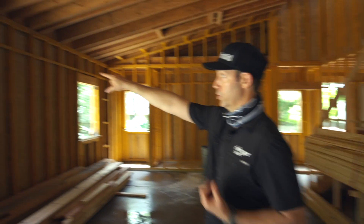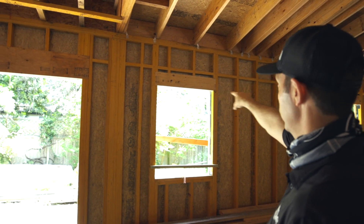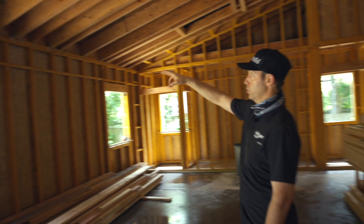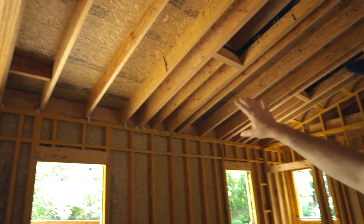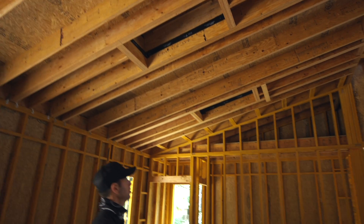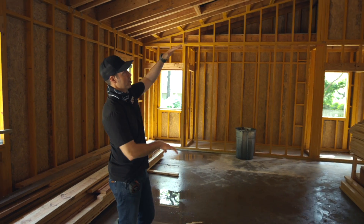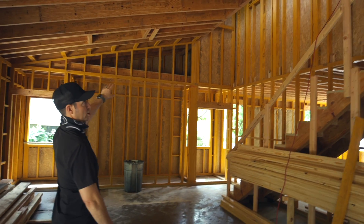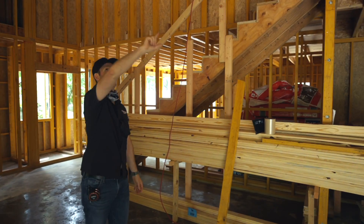Above these windows right here we've got standard inch-and-three-quarter LVL headers, and we also framed our roof rafters with LVLs throughout the whole house. Here in this vaulted ceiling you can see a pretty good span — I think it's 21 or 22 feet from the outside wall to that beam. The beam itself is a built-up member — two plies — carrying that load all the way across, and that load path is carried down to this giant beam right here.